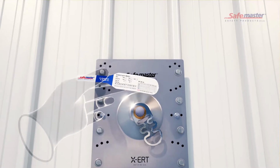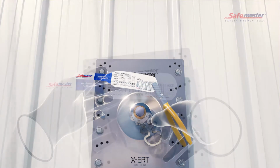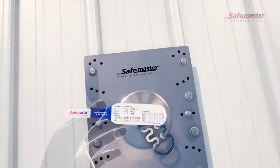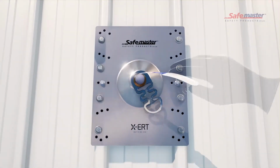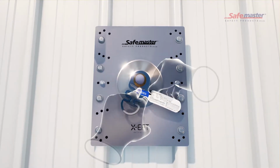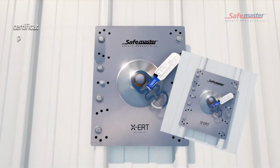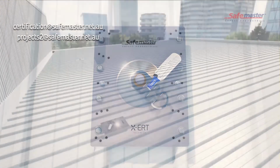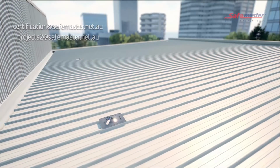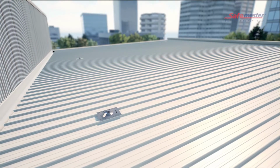Fill in the correct details on the identification tag by punching holes using a hole puncher. Remove the tape liner at the back and secure the tag on the swivel close to the centre with the provided clip. Ensure the swivel rotates freely and clean up the site. Take a selfie of the anchor and forward it to your project manager as proof of install. Run through the APS205 ERT Surface Mount checklist to confirm the installation has been completed correctly.